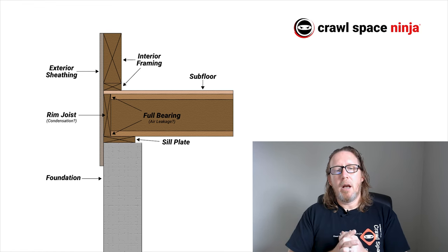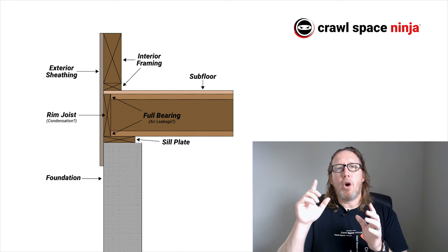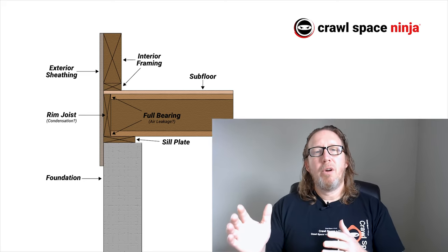If you have subfloor insulation, Brian, I would also recommend air sealing major penetrations in the subfloor around plumbing, electrical, and HVAC to ensure you don't have air leakage in those areas as well. So that is why I recommend rim joist insulation even in a vented crawl space. Number one, it creates a thermal break from the outside which can prevent condensation. Number two, it's that air seal to make your home more comfortable. But keep in mind, if your wood is wet, putting insulation on wet wood is only going to cause major mold problems. Ensure that your crawl space relative humidity and wood moisture is kept in check. I'm Michael Church, Crawl Space Ninja — hope you make it a happy and blessed day and we'll see you later.